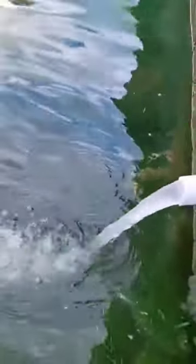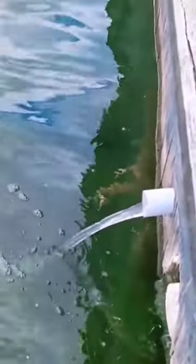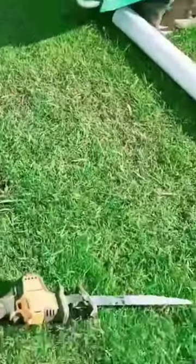When you have a big chamber that stores a lot of water, once the sump pump does turn on, it runs for a really long time. Then it gets to shut down and allow that chamber to fill up again, giving it a break and reducing all those cycles. You only have so many life cycles in every sump pump.